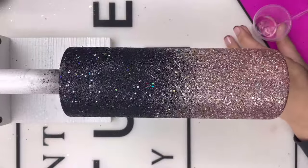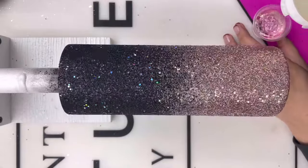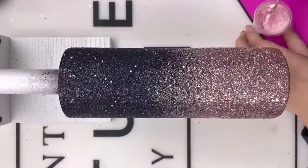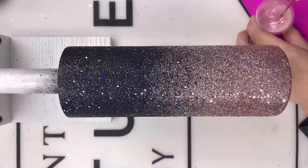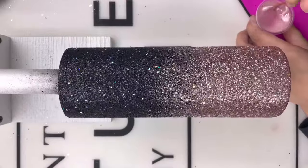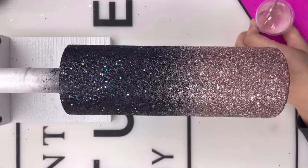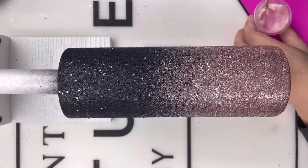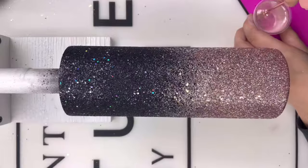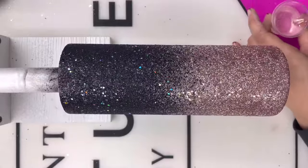Now I'm going in with some more of CCDIY's fast setting epoxy — 30 mls, so 15 mls of part B and then 15 mls of part A. I always put my part B in first, and the reason is that part B is the thinner part and part A is the thicker part. So when I put part B in first, part A sinks into part B and evens out at the line faster. Whereas if I did part A first, it would just sit there and part B would sit on top, taking a little bit longer to settle.